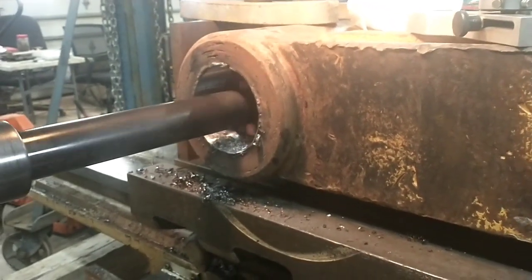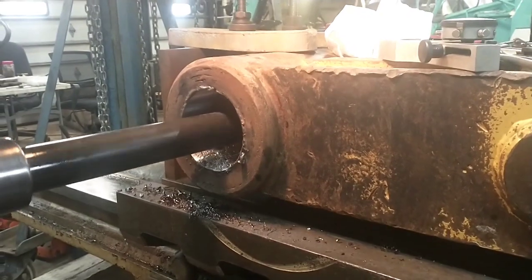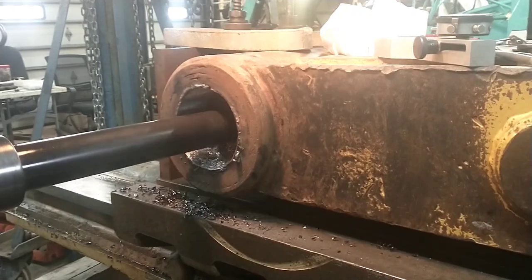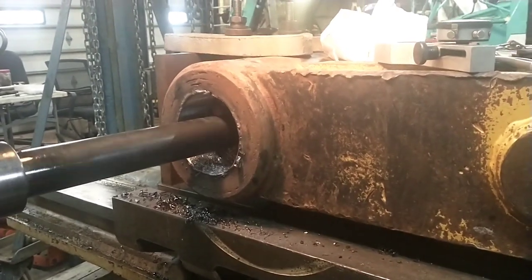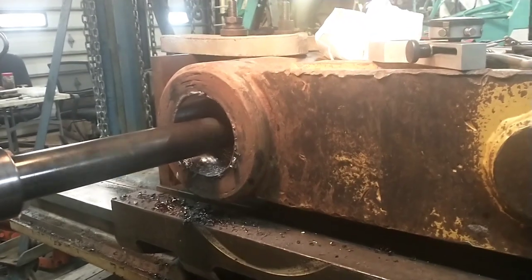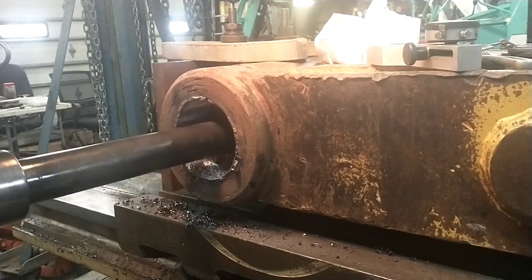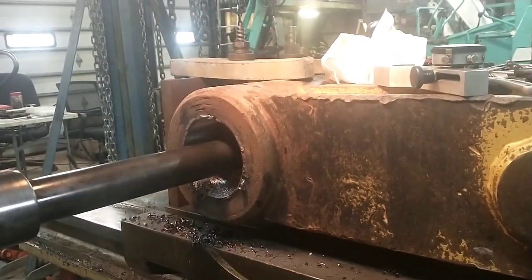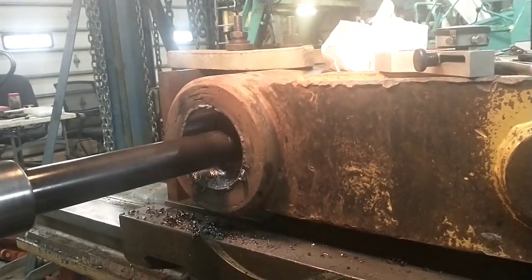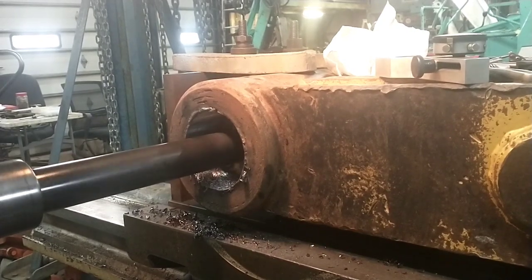Should have one more pass after this. I could have taken it all in one pass, but I wanted to make sure the last pass before this was a pretty heavy one. Even though it was still measuring a little undersized when I checked, I let it cut through there to make sure the hole is nice and true — you get a fair amount of bar deflection under a heavy cut. My final pass I've got about another 5 thou to go, and that one will be nice and dead flat.